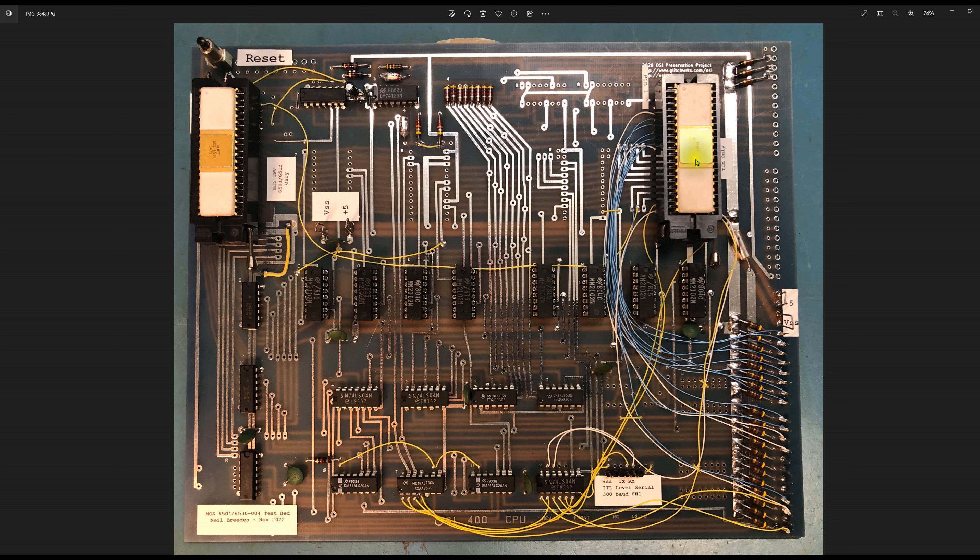The data bus for the system comes off the CPU and travels underneath to the TIM chip. There are a bunch of different 40-pin DIPs from MOS that can sit in this socket, and MOS standardized the data pins across them, so the data pins were hardwired on the board. This was built using the OSI application note one that describes how to get the TIM to work in the system. There was at least one error in that PDF: VCC and VSS are labeled backwards. Since they're hardwired on the board I didn't need to attach those, but if I had used a wrap socket I could have powered the device backwards.